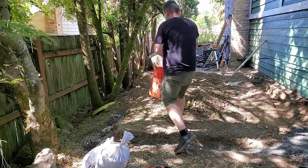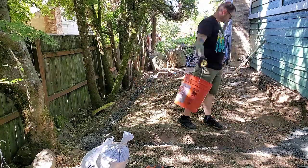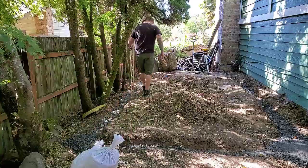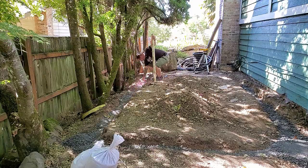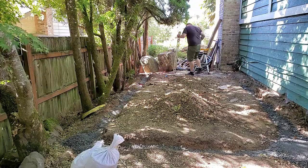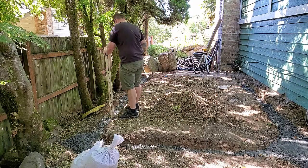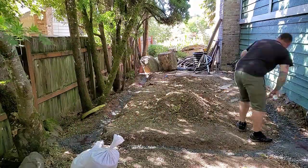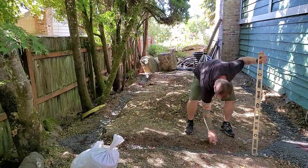The gravel that I'm using to fill in this space is 3/4 minus, and then I'm packing that down. Next thing I gotta do is get my level in place on the pad that exists already. I'm gonna be using part of that pad, so my foundation goes around and meets the pad on both sides. So I'm gonna put the level on the pad and then get an idea of where I am with gravel, as I've been putting gravel into place here, and that way I can figure out where I need to add gravel and where the gravel's too high, if it's too high anywhere, and then I should be able to move forward to putting my forms in for my foundation. So I'm spray painting on the gravel down here, pluses if I need to add.